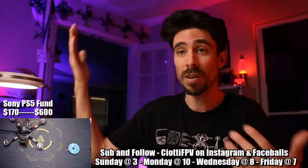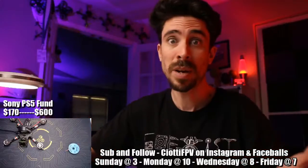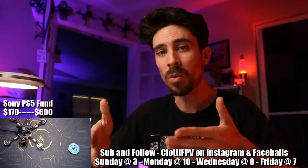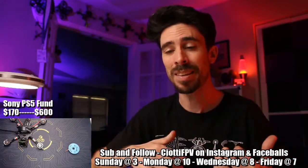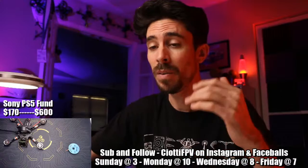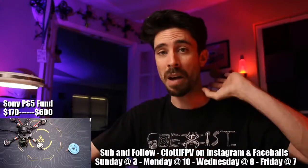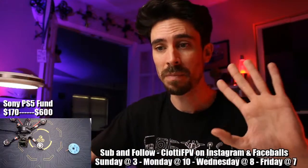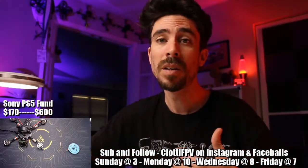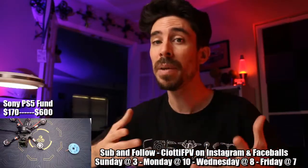When you run your I gains high, because there are benefits to high I gain, it creates bounce back. It's the way that the PID controller works. It's very specifically the way that it works. Our quads are a system that a PID controller works pretty damn good on, but not perfect. What you guys need to realize is that PID controllers weren't created for us. PID controllers have been around forever. They're created for mechanical systems. They just happen to work pretty well on our quads, but they weren't created for us, and they're very limited in what they can do.